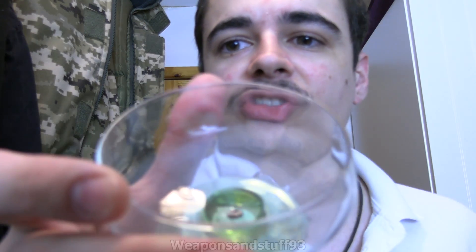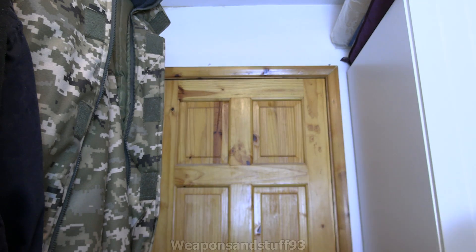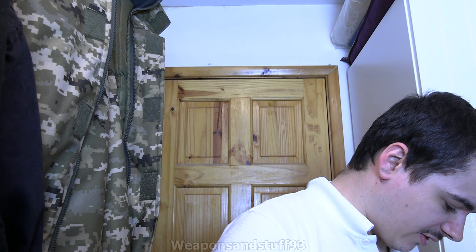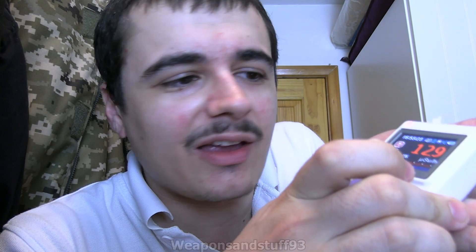One of the really cool things about this is that Americium-241 can be picked up. So if I just put the AM241 in my hand — some people go 'oh my god, why have you put AM241 in your hand?' but it's relatively safe to just do that. There are two little bits of AM241, and popping this over them, the dose massively shoots up — about 12 microsieverts, and turning one over, that's much higher now, about 42 microsieverts.